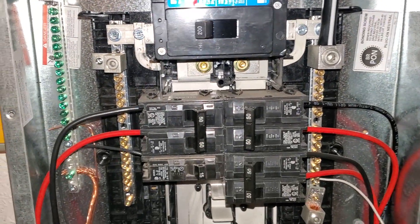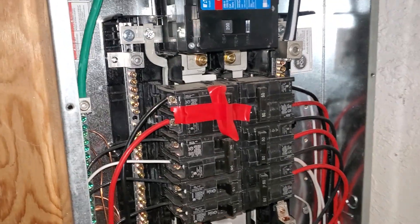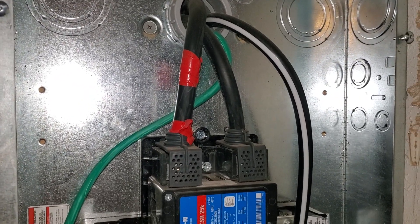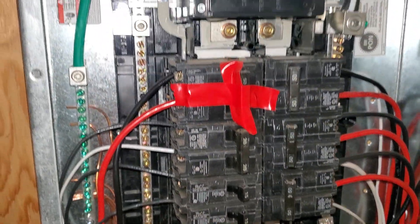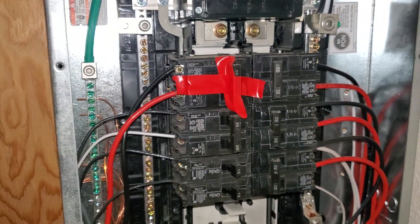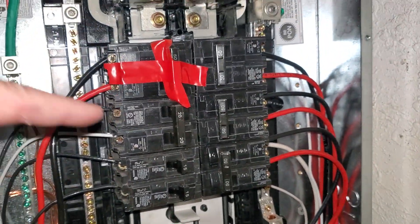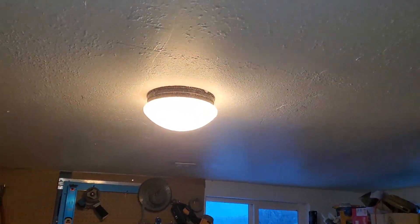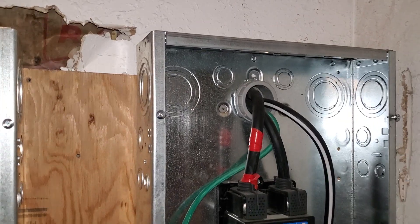If you're going to have grid backup, you have to do this exactly like that. Also, when I leave and come into here, everything is wired the same. I have the lead marked with the red wire or red tape, and all of the breakers are on the corresponding bars. These are my inverters over here. This is the heater for this shed, this is the lights and the plug-in for this shed, and this runs to my service panel in the house.